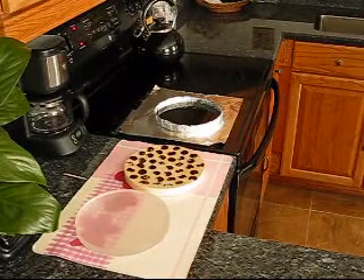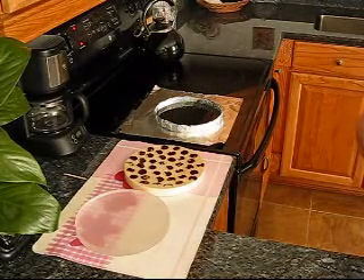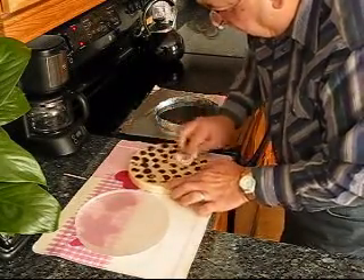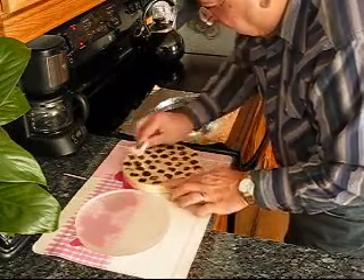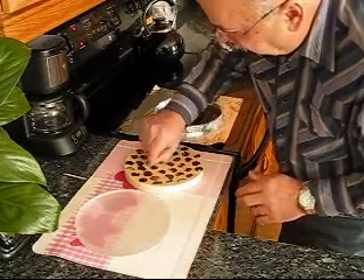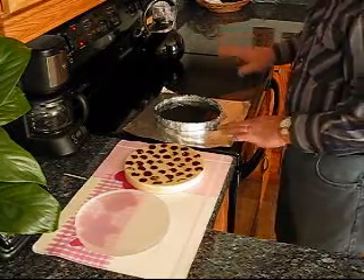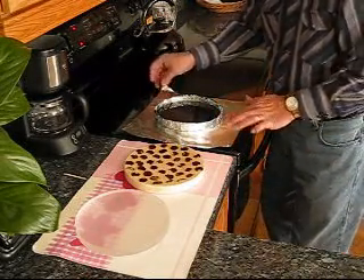One of the things I want to do is take the lap and make it sticky. Take some acetone, just rubbing it over the pitch and lap, and it will dry in a few seconds and it will make the pitch stick to the part very nicely. The cook top is not going to go flat — you might want to rotate it — but it looks like I've got a nice level layer of pitch here, melted.